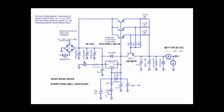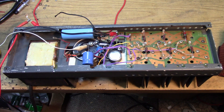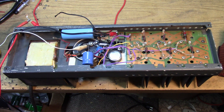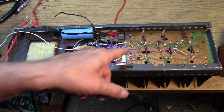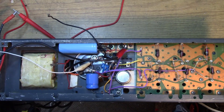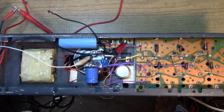Good luck on this power supply - it's working for me. So the rebuild is pretty much completed. I did not have to mount a lot of terminal strips. I just used the components themselves and kind of soldered components between the terminals. I've got a wishbone of resistors that go back to the current sense transistor, which is a transistor that I lifted out of an ATX power supply. You can see it right here, and of course the LM317 right here.